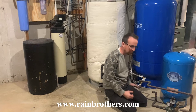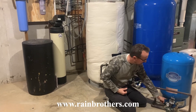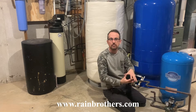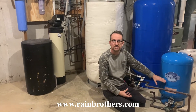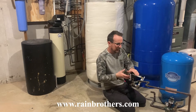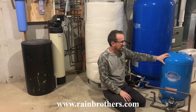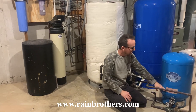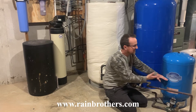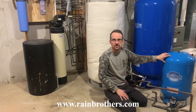How the pressure tank works: the pump will generate pressure and pump into that flexible rubber or PVC bladder inside the tank. It will inject water — up to about 7 gallons in the case of a 20-gallon pressure tank. Once that bladder fills, it compresses the air inside the pressure tank, which increases the air pressure.